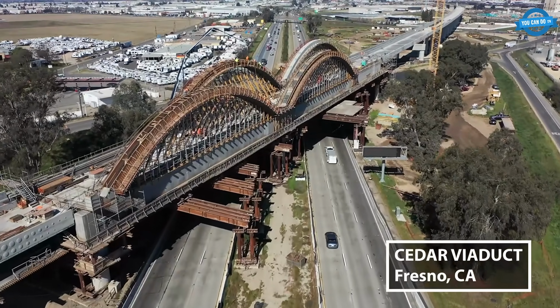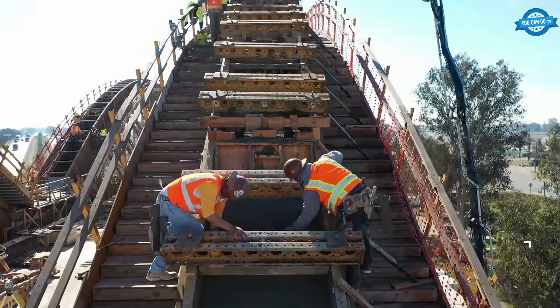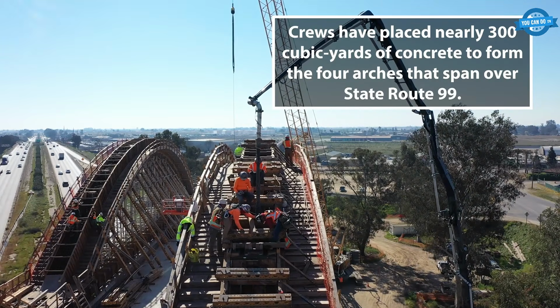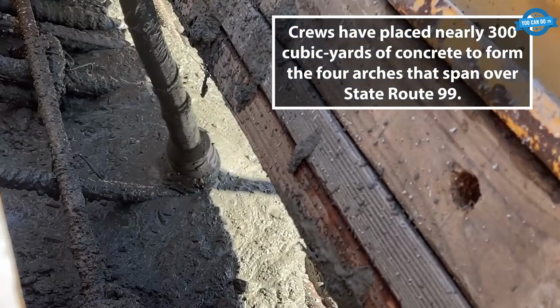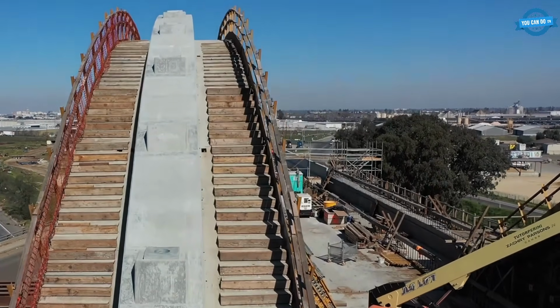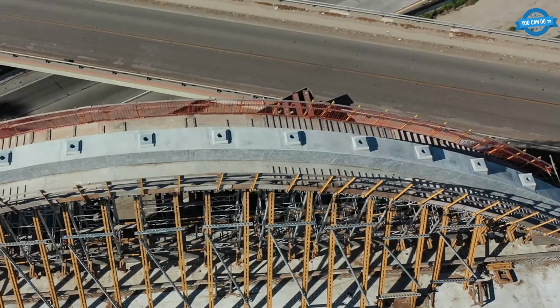Not every high-speed rail viaduct gets built the same way. Some use cast-in-place concrete poured right on the alignment, with heavy formwork and scaffolding standing underneath the whole time. That approach fits short signature structures like arched viaducts crossing a busy highway, where each span is unique enough that repeating a launching cycle would not really save the crew much time or trouble at all.